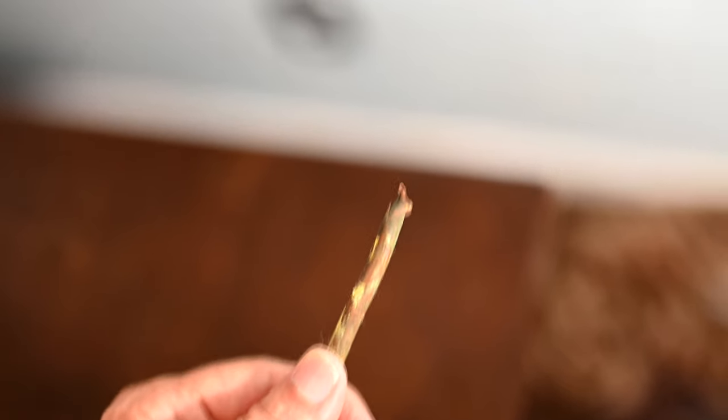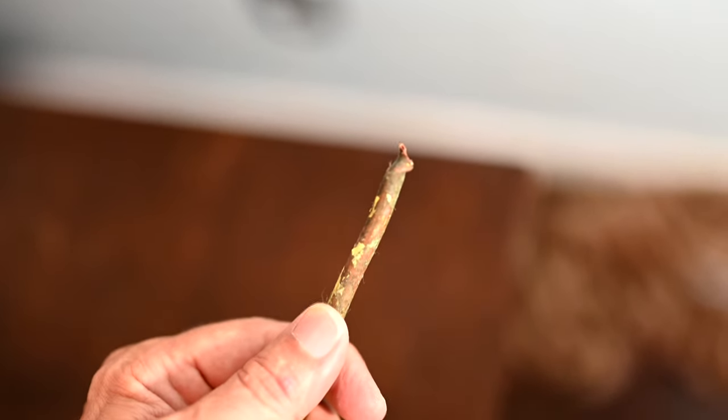Not good. You can see the end where it kinked — see how it pinched in and then snapped off. This type of tubing is just very weak, and over the years it gets weaker. Someone had added shoe molding when they did the wood floors here, and that likely aided in pinching this copper tubing. This is why, in my opinion, this type of copper supply line should not be allowed.